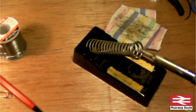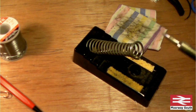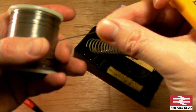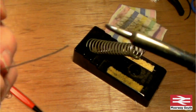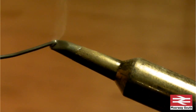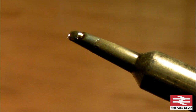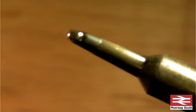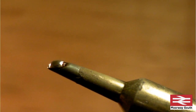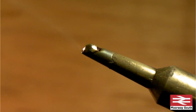It's not so much of an issue when soldering large components, but with delicate electronic components you've got to be really careful because they can be damaged by heat - you've got to solder quickly before the heat gets into the components. With track, that's not too much of a problem, but it can melt plastic sleepers. The key issue with flux core solder is that the soldering will only work efficiently while there's flux burning. You can see as soon as I put it on, lots of smoke comes off - that smoke is the flux burning away, because the solder itself won't vaporize at that temperature. Once the smoke has stopped, all the flux has gone, so you have to work while there's flux still in the solder, otherwise it won't flow properly. You can add more to introduce more flux, but all you're doing is adding more and more solder. So the trick is to work quickly.